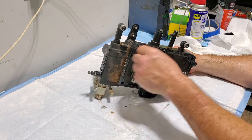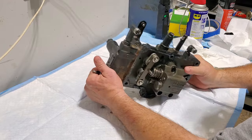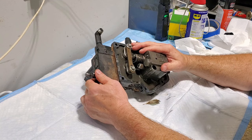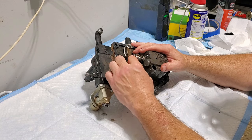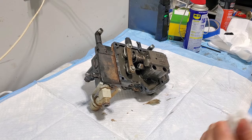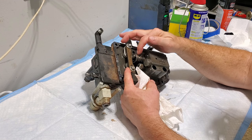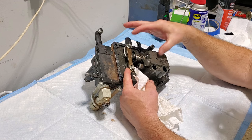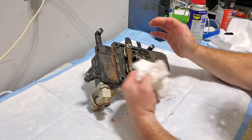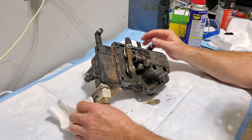Let me see if I can understand why it's so hard to move — whether this piston has jammed up. I think what I'll do is take the C-clips off of it here and then see if these two arms move freely. If they do, then it's definitely the valve. This is your rock shaft control valve — this is the body. Let's do that.